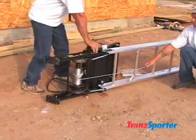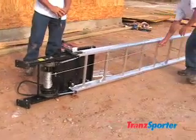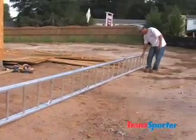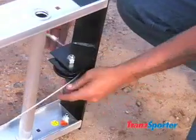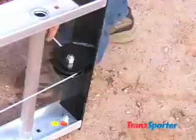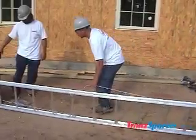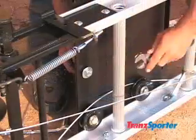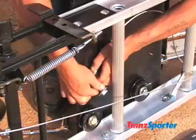To install the cable, turn the hoist on its side. Remove the cable from the cable drum. Using the brake handle, push up to release the brakes while pulling the cable along the track section up to the top cap. Feed the cable through the pulley and down the front side of the track section. Attach the cable loop to the bolt at the bottom of the carriage assembly.